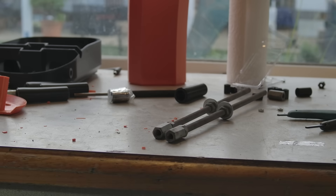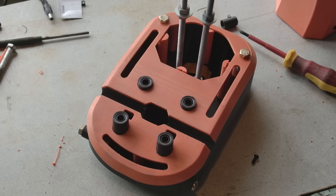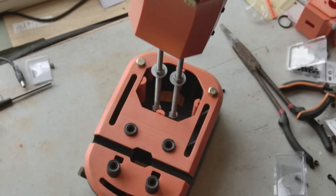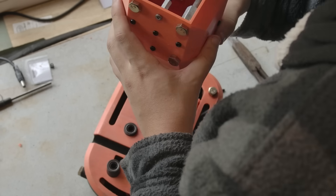I have prepared two lengths of M8 threaded rod, including a flare in the middle to keep it in the concrete. These have coupling nuts on one end which are installed into the base. Following this, the column can be installed over the top, and once you are absolutely ready, glued in place.